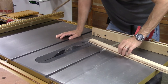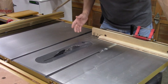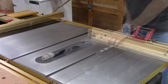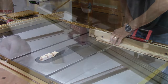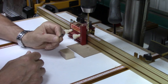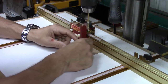I took that piece of maple and cut a 3/8 by 3/8 inch rabbet inside of it. I made a little tick mark at about one inch as a stopping point, and I'm just going to cut off four of these. I'm over here at the drill press table with one of the buttons, and I'm going to be using number eight, one-and-a-quarter inch screws. I've got a 3/32 inch drill bit in my drill press — I just need to put a through hole in here.